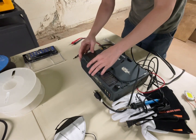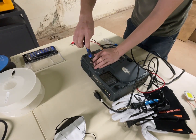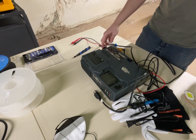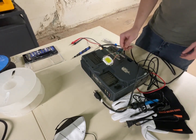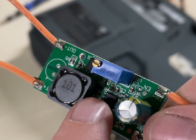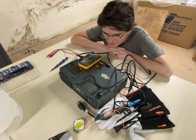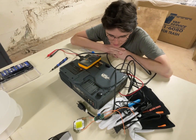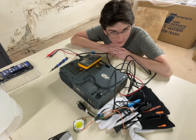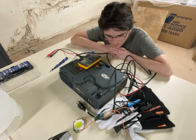For the video, I'm going to work on just bypassing it — bypass that high-voltage power supply, bypass the output, figure out what it requires, trick it into thinking it's on, and just don't even work with that supply. I'll have the power coming through to a 120-volt AC LED, which I'll order. I can use this other stuff for something else. This area inside is a little bit burnt. This is me going down the wrong path trying to do this video, and I've been thinking about this for years — ever since those LEDs got cheap around 2011. I'm definitely changing course because that power supply is just too unpredictable. It does seem like it's a constant current power supply instead of a constant voltage supply.